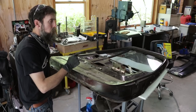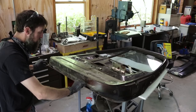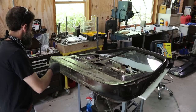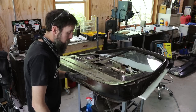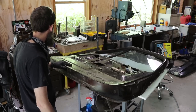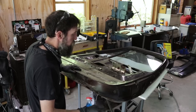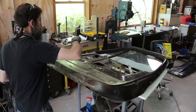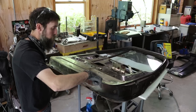So, what I guess I'm going to do is sandblast this real heavy. Even though we do have rust in this bottom seam, and it's against my better judgment, we're going to sandblast this real heavy, both sides. And then work it. And as long as it's kept dry and off the salty roads, it'll last. But it's not the best long-term plan. But you get the idea. At least we have a door to work. So let's strip the guts out of this thing, and we'll take it outside, and then we will blast it with the sand.